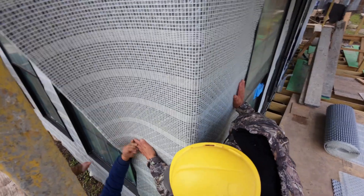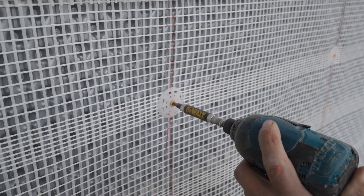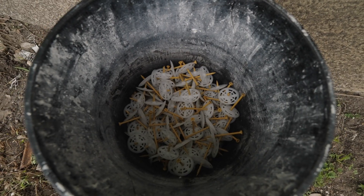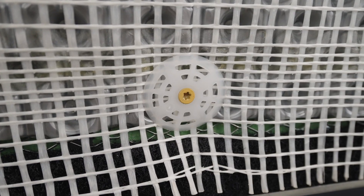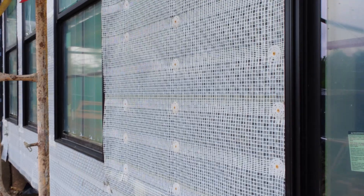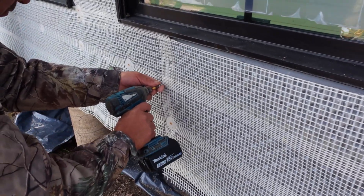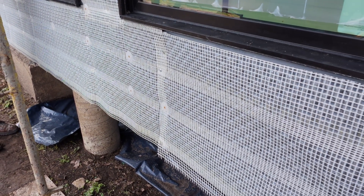Once we got this up, we went back after installing all of our screws to studs. We've used long screws with cap fasteners because we're going through exterior foam insulation an extra long distance to make sure we solidified the hold of this rain screen material to our wall. We've also tacked down areas that might be popped up, using much smaller screws for those.